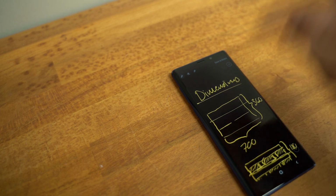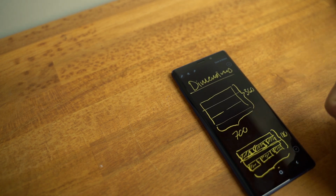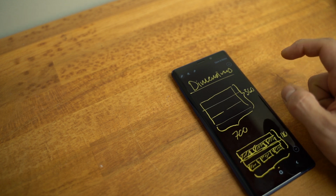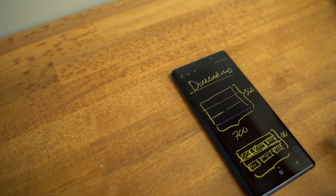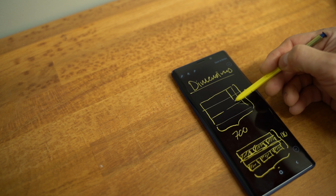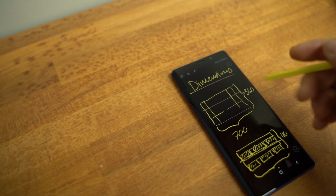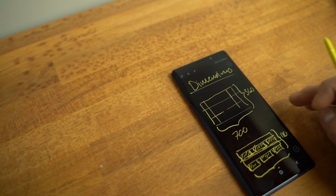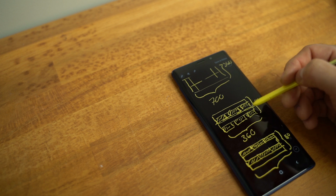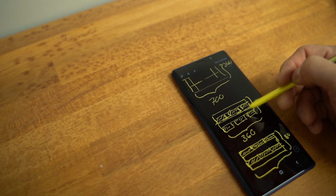This is what I ended up with for the dimensions. The width of the wheel cribs will be 360 millimeters. I have accounted for the tires having a certain maximum width with regards to the summer tires. For the length I thought 700 millimeters is appropriate, and potentially I can put some board along this edge here and here in order to prevent the wheels from rolling. The height will be 180 millimeters, so it's 4 layers stacked on top of each other.